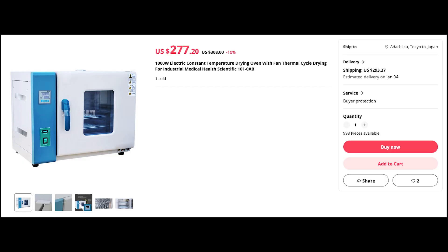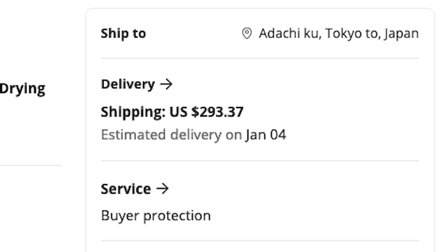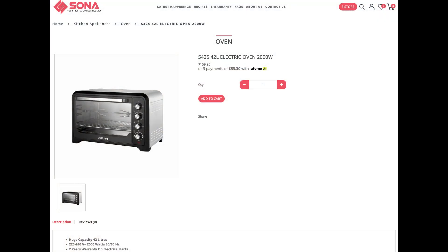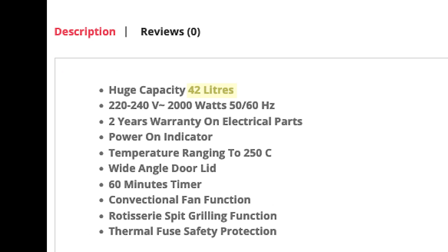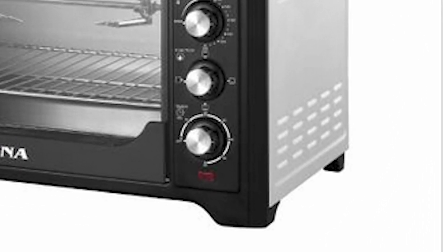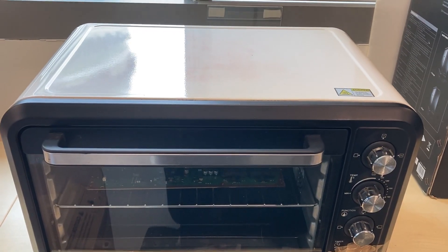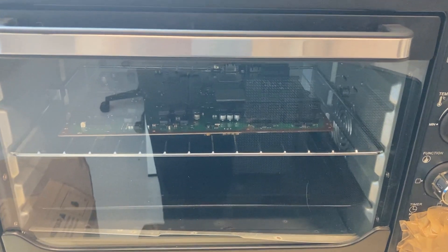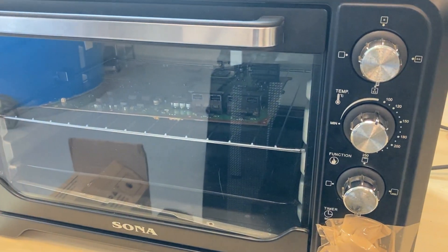So I decided to buy a PCB pre-baker, but the cheapest one I could find is already over 200 USD, not including shipping. I need to be creative, and this is the solution I came up with: a domestic kitchen oven. I picked one with a high enough power output that is large enough to fit a PS3 motherboard, though it can only run up to 60 minutes. We need a way to force it to run continuously for up to 24 hours. I bought a used one for around 22 USD. I put tape on the timer knob so it will never go to zero — the only way to turn off this oven is to cut the main power. I test-ran it for about 4 hours to make sure everything was okay, then ran it overnight.